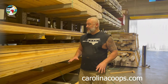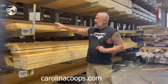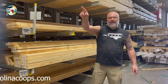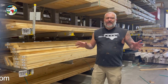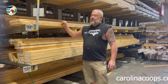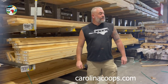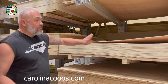In the Southeast, or if you're in the Pacific Northwest or anywhere on the west coast, you can find some really nice lumber. Here we have southern yellow pine, versus the white wood on the other side — I don't like it, it's way too soft. When you only need a couple pieces of lumber for this application, I would grab the southern yellow, or if you're on the west coast, take advantage of Doug fir.